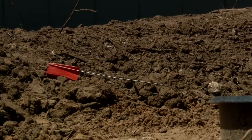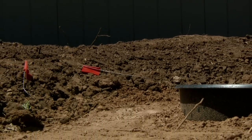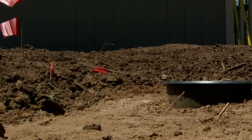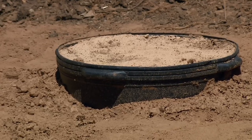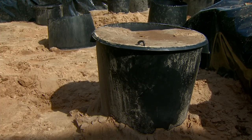If your cistern is in an area where exposed soil might wash into the depression, a berm will help keep this contaminated soil out of the system. Now to increase the percolation of water into our sand layer, we're going to include a few areas that are free of soil where sand columns extend from the surface down into the sand layer below.